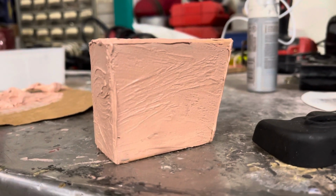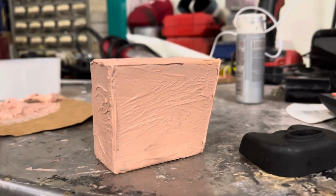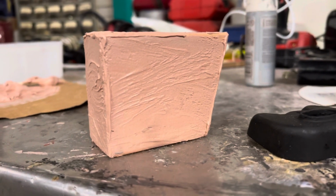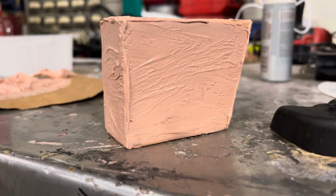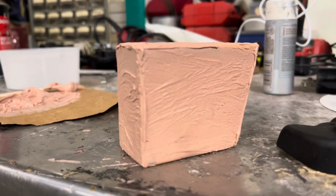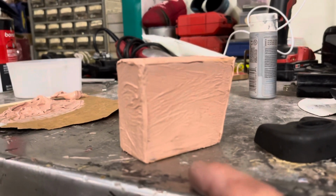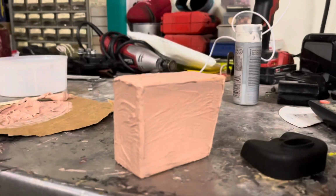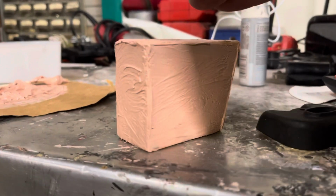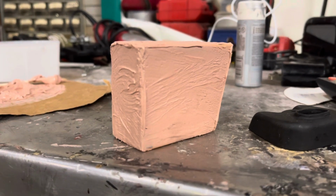So let's let it dry and then I'll sand it down and show you how it's gonna look. One thing you notice, it's sitting like this because you really don't need to do the bottom. You just don't want the bottom to look like crap. You want it to be somewhat smooth. We're gonna grit it up and make it look good. So the back side of this, the bottom isn't bonded. The biggest sides to get is this side and this other side where the grain is at. But we want this top smooth and we want this front smooth. So let's let it dry and then sand it.